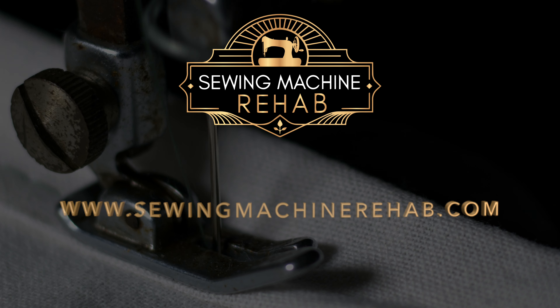So: 2-56 tap, in and back out, using an old pair of jeweler's pliers to hold it steady — and thankfully it worked. I know some of you wanted to see this; this is not how you tap a hole — let's just be honest and straightforward. If you needed to tap out a hole, you would need better supplies. This was me winging it, trying to make do with what I had. But the good news is the problem's gone. I can forget about it now. I look forward to seeing you guys really soon. Bye!